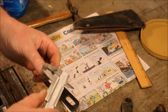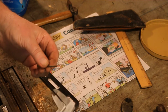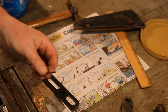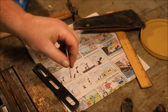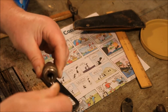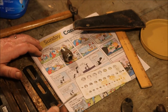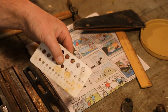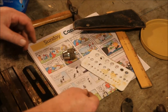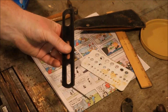Through trial and error I've discovered that this nail, which is 0.118 inches in diameter, fits perfectly into the drive holes on the chuck. 0.118 is just slightly smaller than one eighth of an inch, which is 0.125. So if I drill a one-eighth inch hole, that pin is going to slop around in there and not work very well.